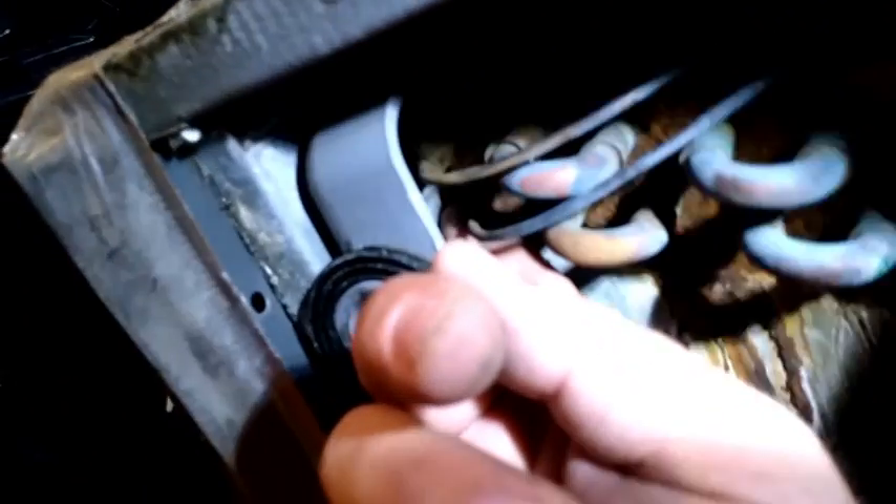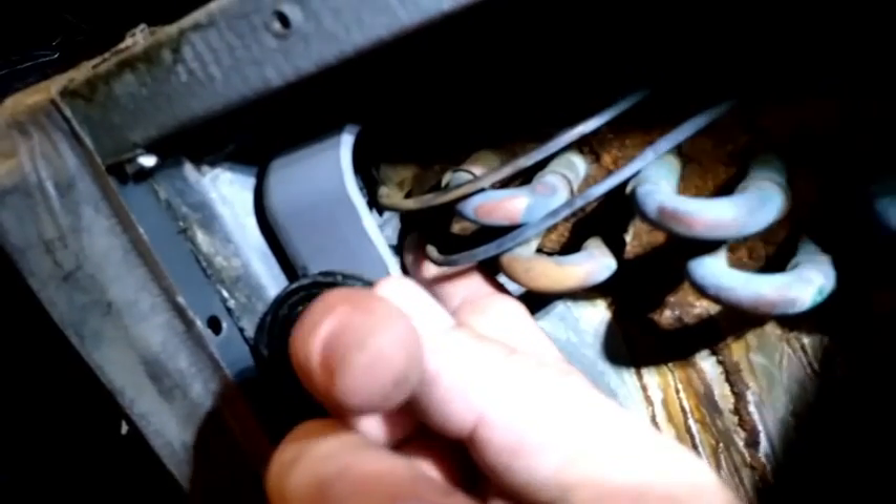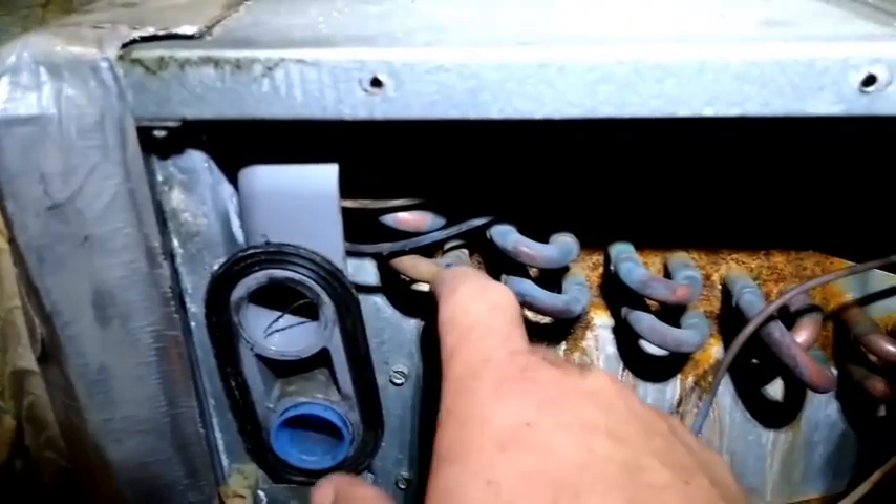There's some burning on the brazing right there — good grief, you can hear it. I'm opening it up to see what we find on the inside. The coil plate is kind of rusted out; it's actually falling apart over there. We need a new evaporator coil. You could try to braze those things up, but the coil is falling apart so badly it's just going to break again.